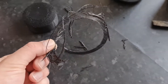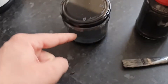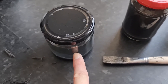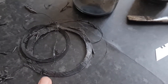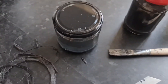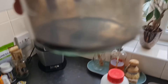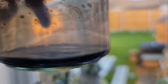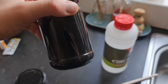This is actually fine like this because it will dissolve very fast. That's the reason why you want to cut it into small pieces. You want to put this in the acetone — just pour 50 mils of acetone. And then add, if you want to make ABS juice, just add about 15 to 20 grams of ABS in there. That will dissolve pretty fast, just keep agitating it. The consistency — the viscosity — you want to achieve is thicker than water but not thicker than milk.